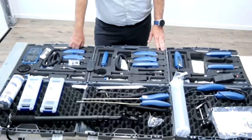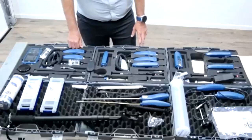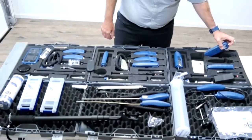It always depends on what you want to use these instruments for. If you want to use them in a very, very dusty environment, for example, you could use one of the other two variants because they will protect the sensor better, but they will also be slower. So you will have to wait for a longer time until the meter adapts to the current conditions. Is one more accurate than the other? No, the sensor's all the same, but it's just about protection and airflow. Okay, that's the difference. Fantastic.